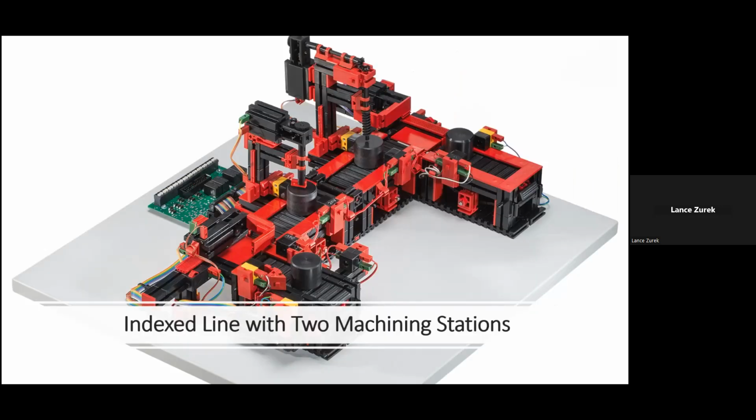The next model we're going to look at is an index line with 2 machining stations. This model features a U-shaped conveyor line consisting of a milling and a drilling station and 4 conveyor belt sections. Other components on this model include 8 XS motors, 4 push-button limit switches, 5 phototransistors, and 5 LED light barriers. The dimensions are approximately 19 by 18 by 11 inches, and it has a weight of just about 2 pounds.